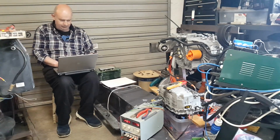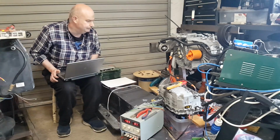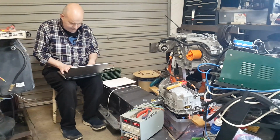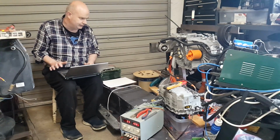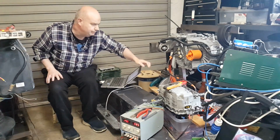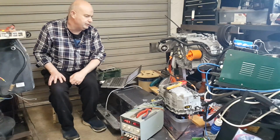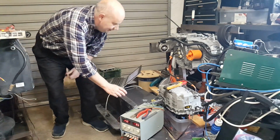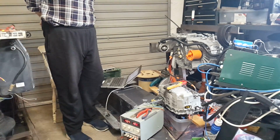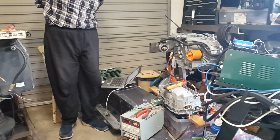Now what I'm going to do is go into the manual ID parameter here. I'm going to command 10 amps, going to press enter. What I've seen here is the current pop up to about 10 amps. Now it's dropped down to 1.2 amps. That's AC. If I flick my meter to DC, I'm seeing 8.5 amps DC. Now is that supposed to be like that?